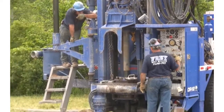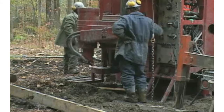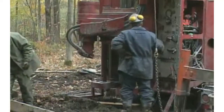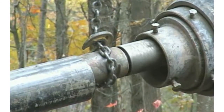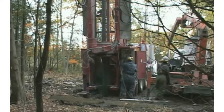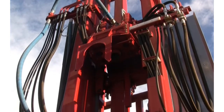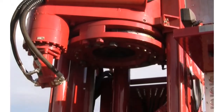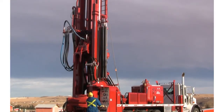The DR-24 offers greater flexibility and is a popular model for drilling contractors looking to broaden their range of services. It is used both for small diameter work like domestic water wells and on larger construction applications such as elevator shaft holes and foundation piles. The DR-24 HD features a heavy-duty lower drive with twice the torque of the standard DR-24, and is most often found working on deep water well and mine dewatering projects.